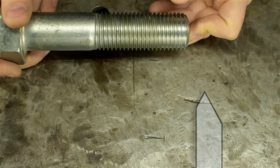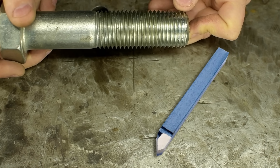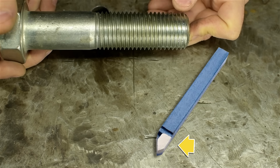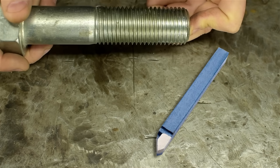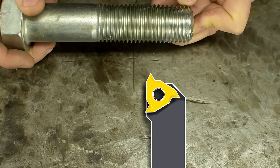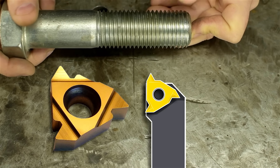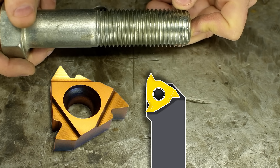After the high speed steel tool, maybe you've got brazed tools — some kind of a mild steel shank with a little piece of carbide brazed to the tip. The carbide again has the thread form shaped into it that we want to transfer into the part. Carbide tip tools are exactly the same as high speed steel, except they shatter the very first time you use them. Then of course there's insert tooling. Same story here, except the thread form — the shaped cutting edge — is baked right into the insert. And usually they have two or three tips you can index to when one breaks or no longer cuts the way you like.